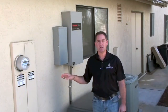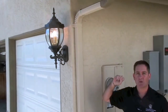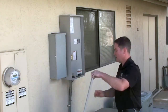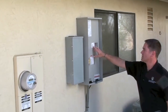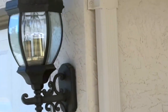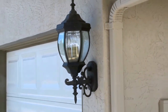I'm going to simulate a loss of utility power, and we're going to see how that affects the house by watching this porch light. Right now the power's on — we've got perfect utility power. But I'm going to demonstrate that loss here at the transfer switch. Right inside of the transfer switch, we have a circuit which is our new utility service disconnect. So if we need to work on the house, this is where we turn off the power. Now let's watch this light, which is now off, and we'll see in a few moments. The generator will kick on, and the lights will come back.